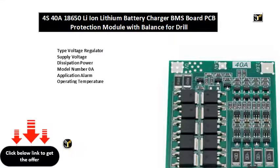Charging voltage: 16.8V to 18.1V. Continuous discharge current upper limit 40A — if the cooling environment is not good, please reduce the load current use. Continuous charge current upper limit 20A. Equalization version suitable for starting current below 80A, power 135W below the drill.